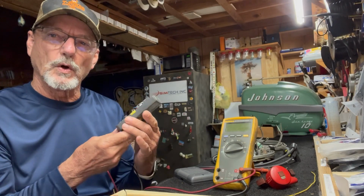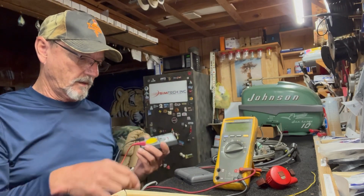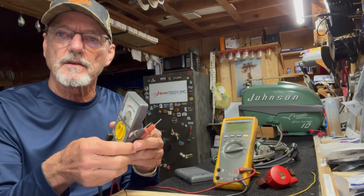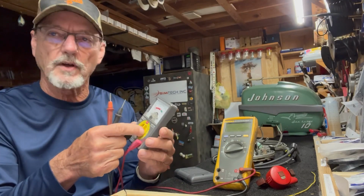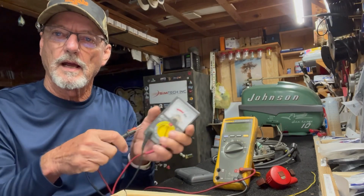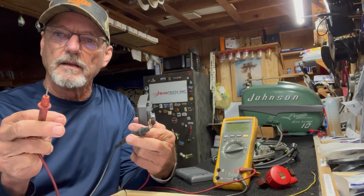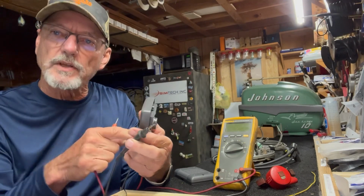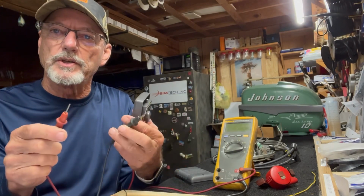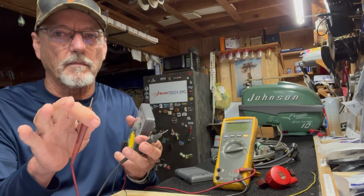All right, so that battery is what is used when you connect the leads to any 2 points. This voltmeter, depending on what you have it set on, discharges this battery out one lead and expects to see it coming back on the other lead. So if you're measuring voltage, you set it on voltage and touch this to ground and this to the lead, it'll measure voltage. If you're checking ohmage and you set it across the 2 leads, it'll measure ohmage. And we're going to talk about all that later.